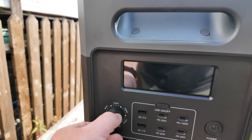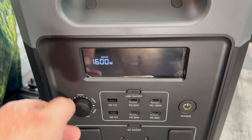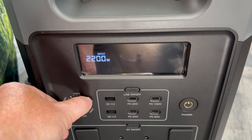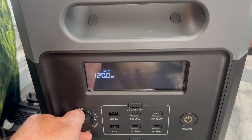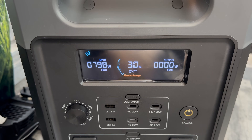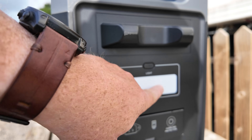A cool feature is charging. As well as being rated for a high charge, you can actually select the charge rate using this little knob. You can set it to whichever power source you want. If you have a 2,200 watt home hookup, you can charge at max power and get it charged in just over an hour. Or if you're on a campsite, you can take it down to 400 or 800 watts — or even lower if charging from an inverter in your van.